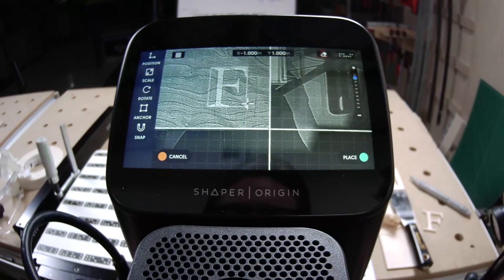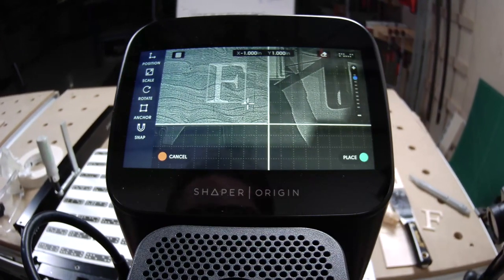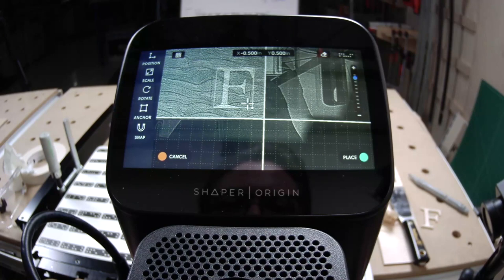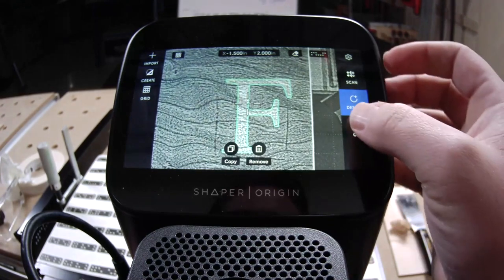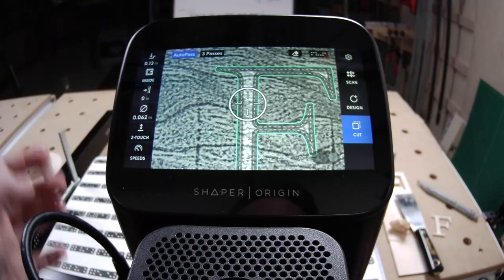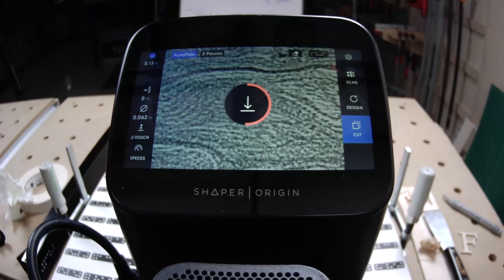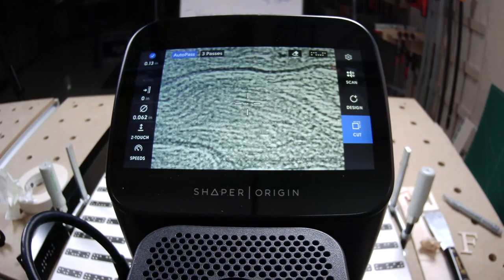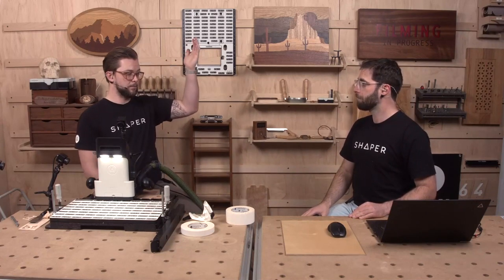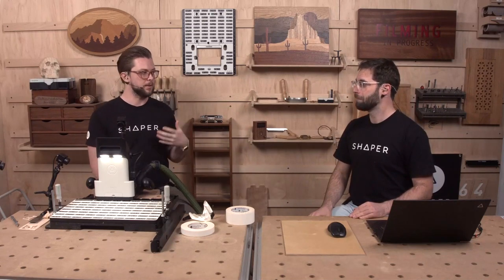The file synced as an inside cut. We want to do pocket first, then Z-touch as always just to be sure. Going for it with the sixteenth-inch bit again: pocket first, then change to an inside cut. And as always, cut to a zero-inch offset first as a sanity check — test fit your piece, then move into your negative offsets. We're going to expect probably a small negative offset on this.